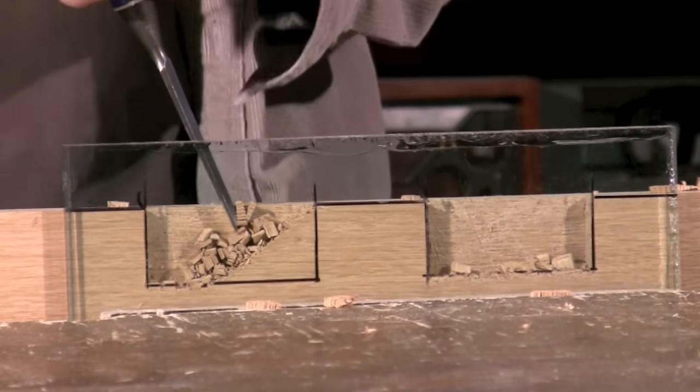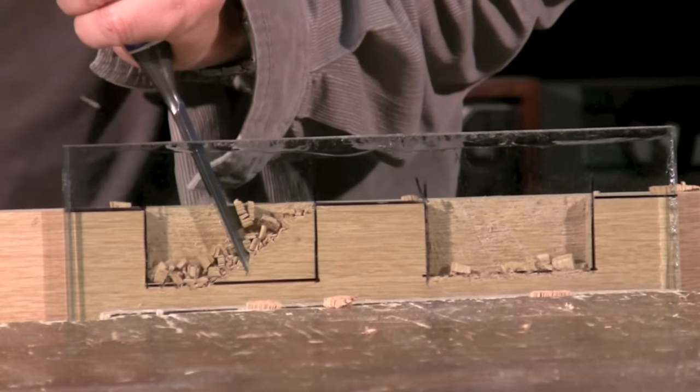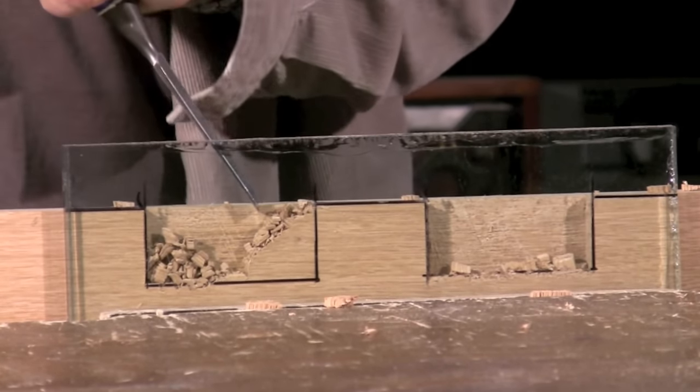Watch this — the perpendicular aspect of my bevel goes right down to the bottom, and then I move across. I'm pretty much to depth now. It's really effortless. If you take about an eighth of an inch it just goes very quickly. See the advantage — that leverage right at the bottom of the mortise hole. So I go with a thinner chisel again just to clean out the waste, and we are pretty close to the bottom of the mortise from both sides.